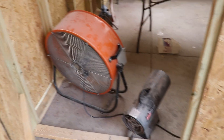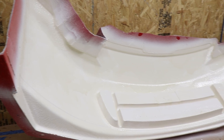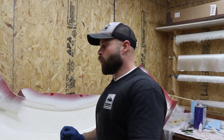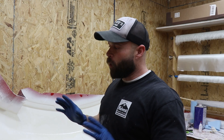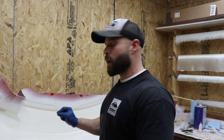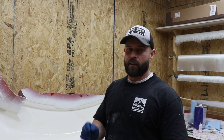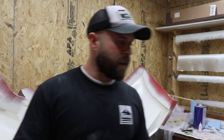I'll add some heat into this shop with my torpedo propane heater. We've done that skim coat and thankfully it appears it will not cause any alligatoring with the gel coat. So while it's still slightly tacky, we're going to apply some fiberglass veil to some of the more difficult edges where fiberglass chop strand mat will not adhere very well. There will surely be some bubbles. I don't want to use a lot of chop strand mat because it's not very structurally strong and it cracks very easily. So let's go ahead and apply this fiberglass veil.